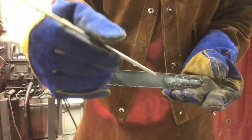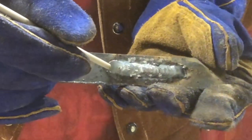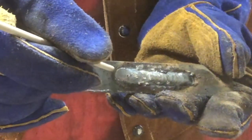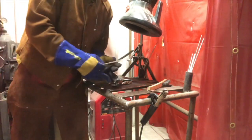The way that will look: we'll be welding, getting our position and everything ready, then we're going to strike the arc in that crater, push the electrode back, and continue our circle pattern like we never stopped — and then move on. You need to be able to do restarts, friends.